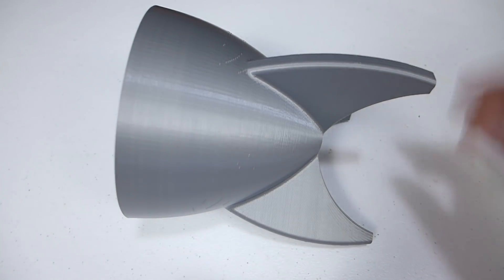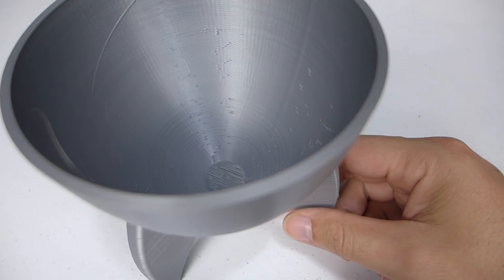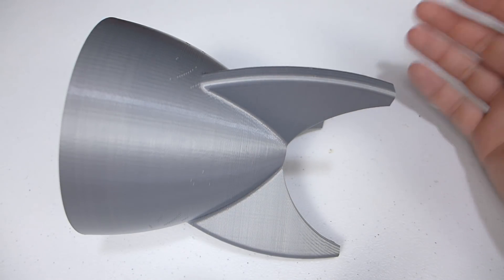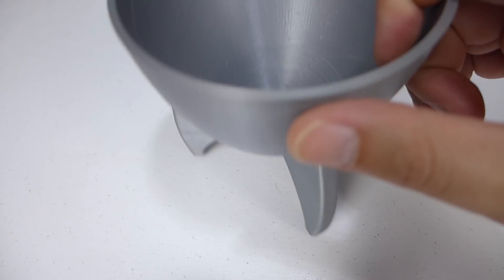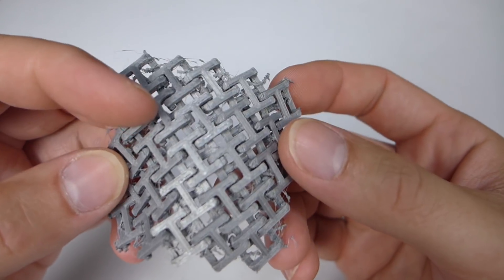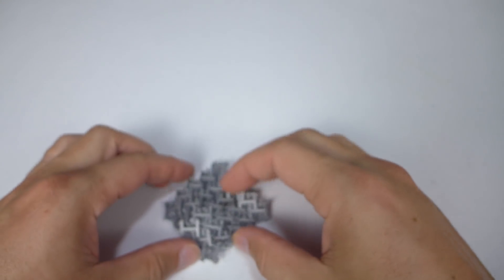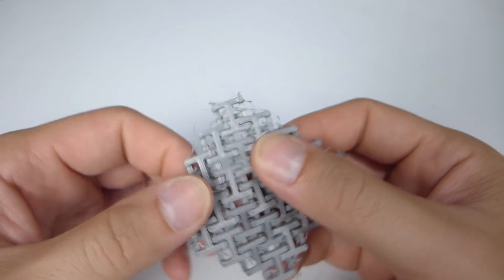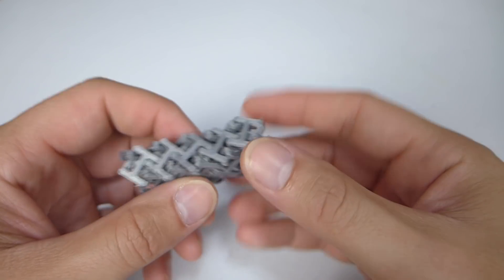I also printed a big retro rocket vase — a rocket planter. I printed the one without the hole in the middle; my wife pointed out it needs a drainage hole, so I'll need to add one. I'll probably print this in another color so both my older kids can have one to plant in. As for the chain mail, the bottom layer was fine, but when you look at it from the top you can see all the bridging issues. I'm going to try again, either with Simplify3D or on another printer.